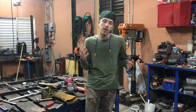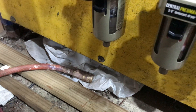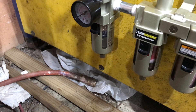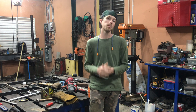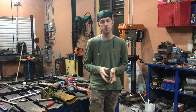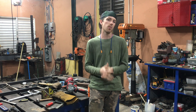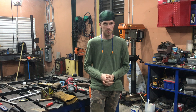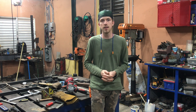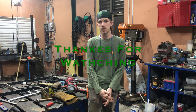So how well does this actually work? It really does work quite well. I've been doing a lot of plasma cutting and painting and it works great. After three or four hours of running air through it, depending on humidity and temperature, you might need to dry your desiccant out. But it removes a huge amount of water from the air — my consumables have lasted way longer and my plasma cut quality has improved. Ideally if you're doing this all the time you might want a refrigerant air dryer, but on a budget or if you're willing to regenerate the desiccant, it works really well. Hope you found this helpful!